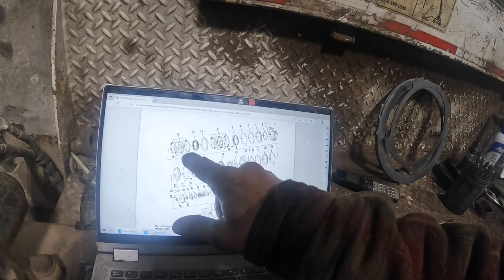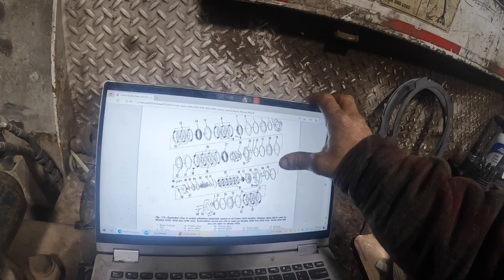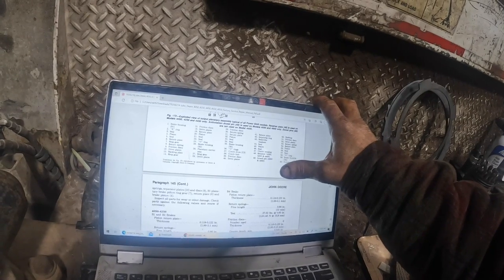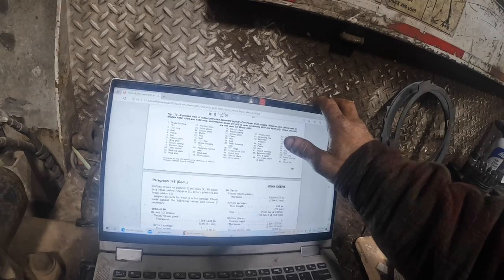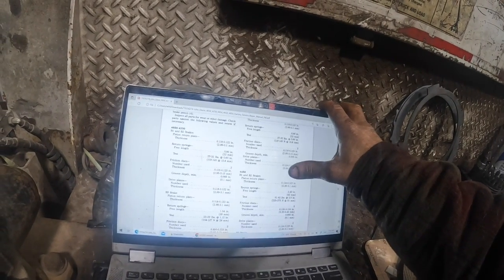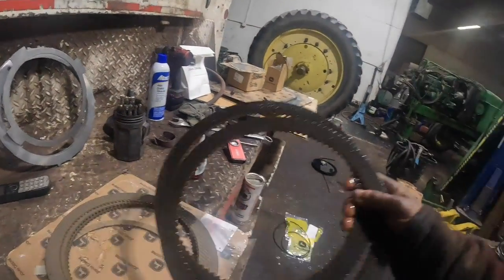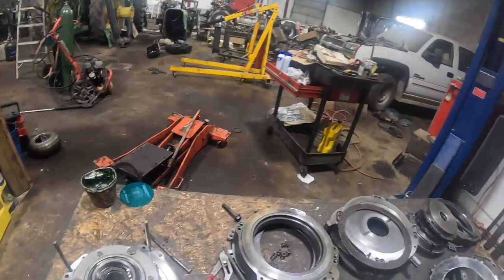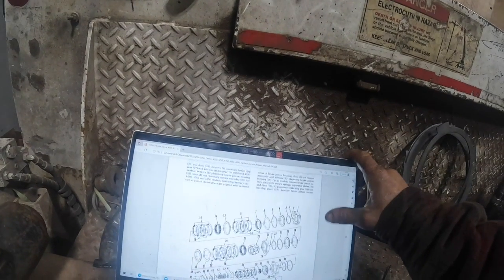So obviously we have to go off this B1, number 15, friction disc. That's going to be the B2 clutch pack. How many friction discs are there in it? There are 2 required, which I've got 2 soaked here. I've got to soak some more. But let's look at our exploded diagram here.